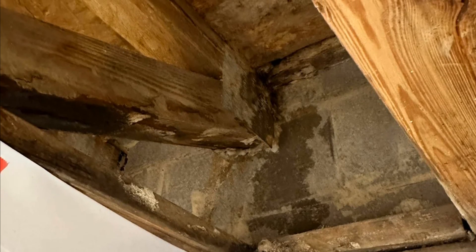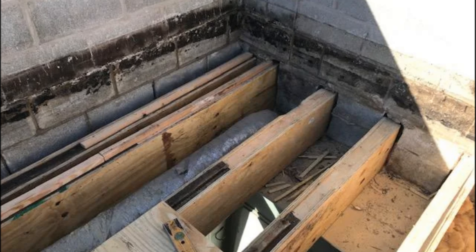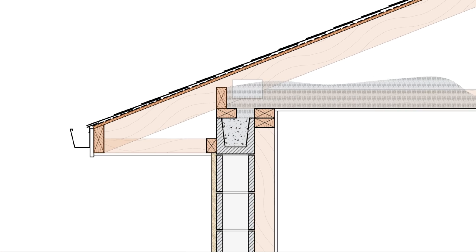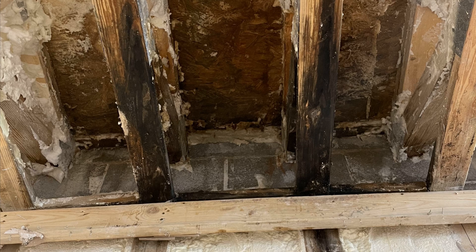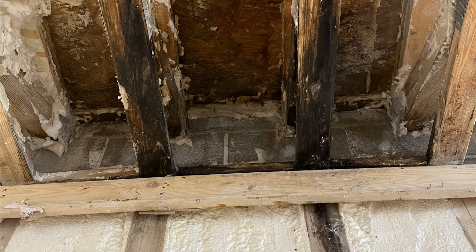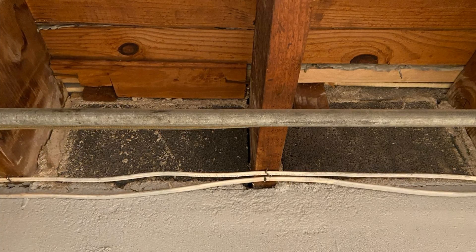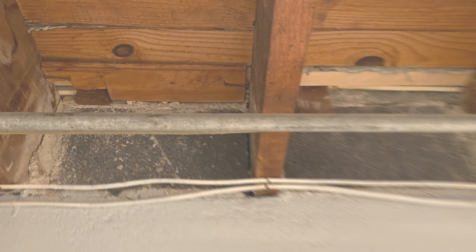Unfortunately, we often see that the roof structure is either embedded into the concrete block — often in flat roof systems — or it's bearing on top of the CMU wall without a capillary break. When we go to insulate those walls, those embedded ends stay wetter for longer because we're slowing down heat flow, and that's where we tend to see problems occur. That's also why older, uninsulated buildings could get away with having no capillary breaks between the masonry and the wood.